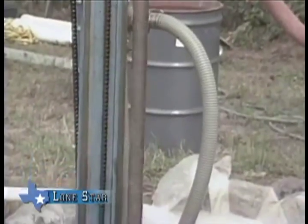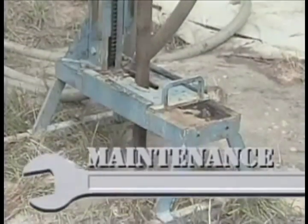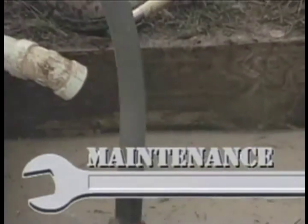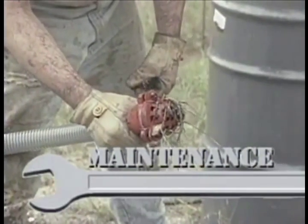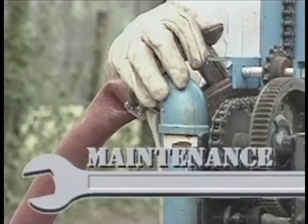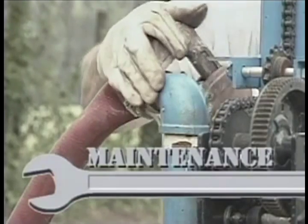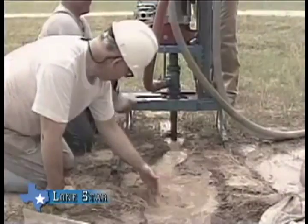When the drilling mud slows or stops coming out of the borehole while drilling, this indicates lost circulation. The most common causes are a clogged suction strainer, a blocked borehole, a crimped hose, or a porous formation allowing excessive amounts of mud to escape. To correct these conditions, refer to the well construction reference manual. When the rotary reaches the table, the shuttle will rest on the stops — allow sufficient time for the cuttings in the borehole to clear.